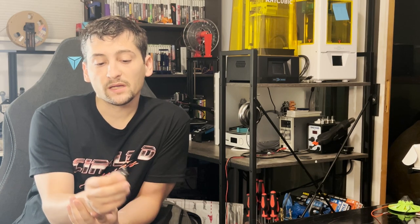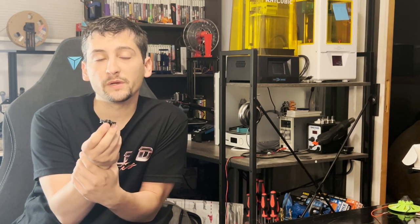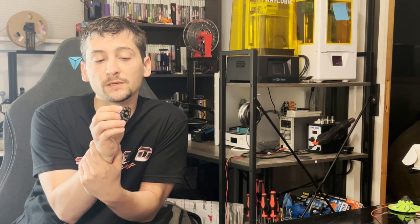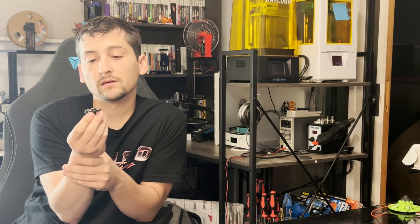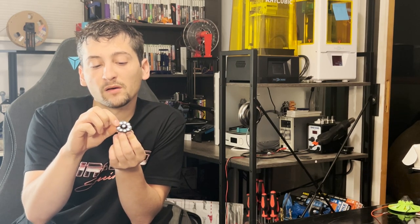Also, in the motor assembly, it's now, as you can tell, it's detachable. So I can change between different speakers with the same motor. It just holds on by three bolts. And this assembly, I went from, I believe, the last one was seven magnets, a seven magnet array, to a nine magnet array. And then these magnets are now double stacked.